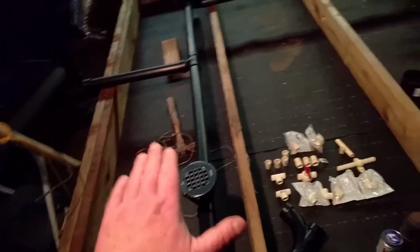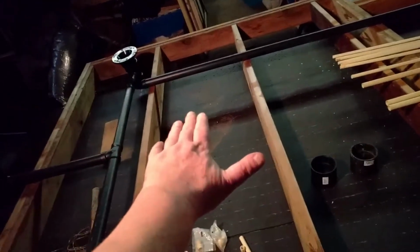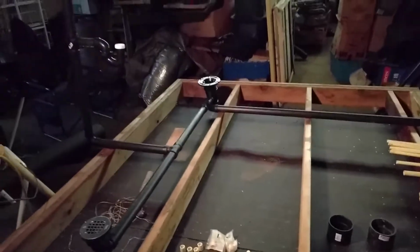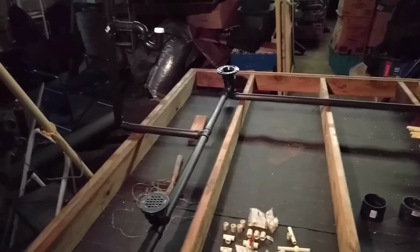The only thing that's going to be inside the floor joist is going to be the water lines, which are also going to be running from the front back to the water heater, then over to the sink. Then one hot water line will be running back up here to, there'll be a wall right about here. And the door opening's right here. But anyway, the shower is going to be right here. It's going to be a 32-inch by 32-inch shower. And yeah, I thought I'd just put an under-counter standard type, probably a 20-gallon hot water heater under there.